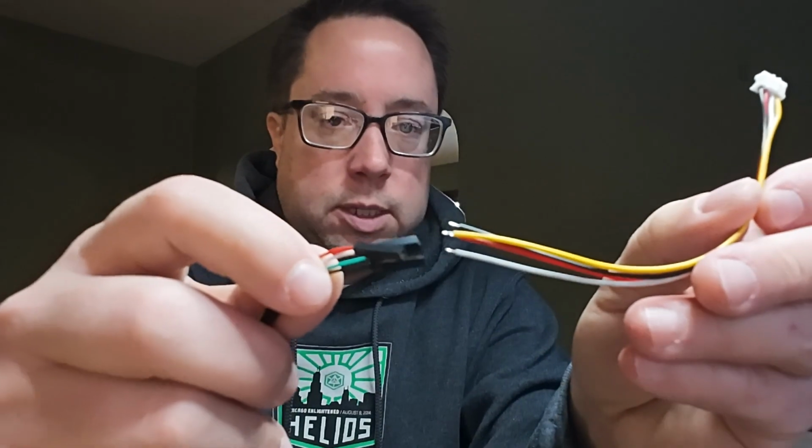and then he bought some USB dongles, which are just generic USB serial converters, and I'll put a link in the description below, that work with the Cerbo GX. And then there's the Venus OS for the Pi, and then it's got these leads. One of these is power, one of these is communication, and there's a whole mapping that you need to do. You take one of these, and then one of these JST connectors that I'll link below, and they've got a lead on them, and connect these into each other, and that's how you connect the Victron components to your Raspberry Pi.